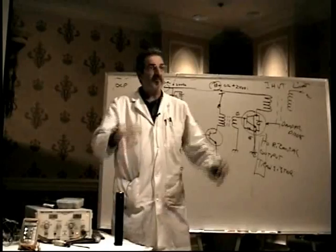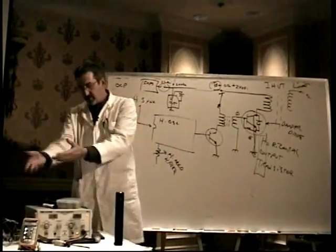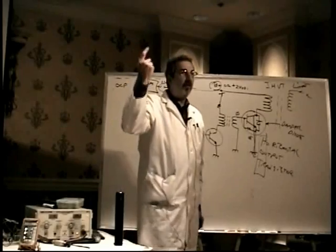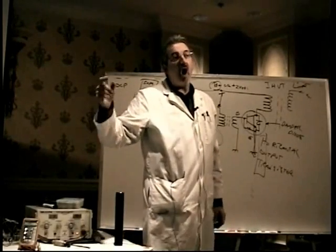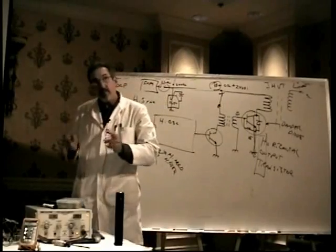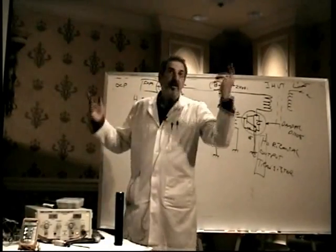It only takes about 5 minutes to jerk a monitor out, take the board off like I've done here, 3 solder joints and 1 screw, and I got the thing out, put the new transistor in. Always screw it in first before you solder it in place, because otherwise the hole won't line up right. You'll do this wrong once, and you'll never do it wrong again.